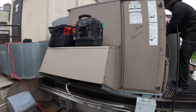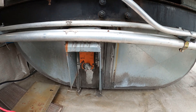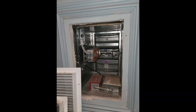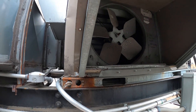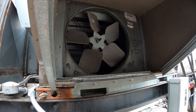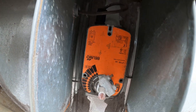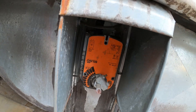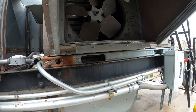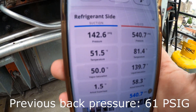With a little bit of research, I went downstairs into the hallways and found that the supply ducts were all closed. That led me to believe that the fire alarm system had shut down — and it actually did. What happened is, when the fire alarm system shuts down, it closes all the supply dampers. Because they're motorized, they have actuators that electrically open and close the damper. That's why we had poor airflow. Once we got that back open, we had a tremendous amount of airflow, and our pressures changed a lot. We got the back pressure up to 142.6.